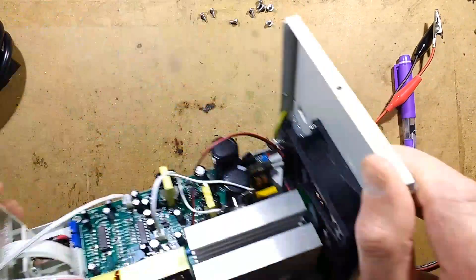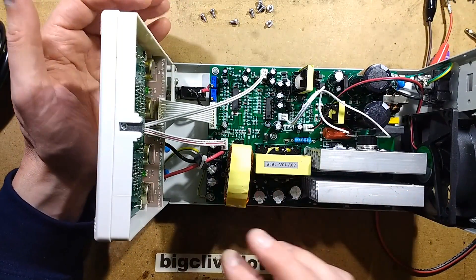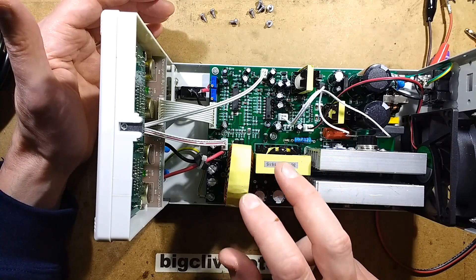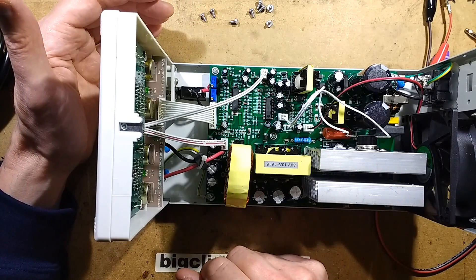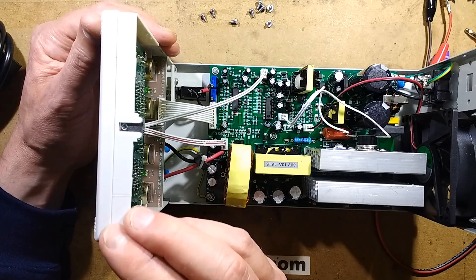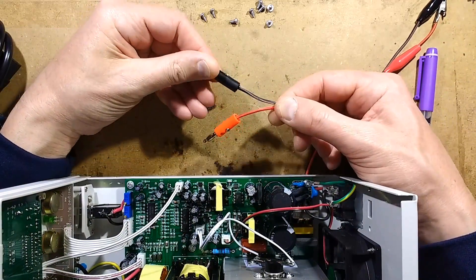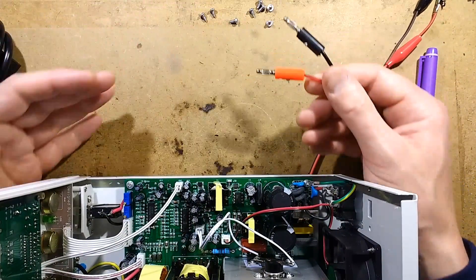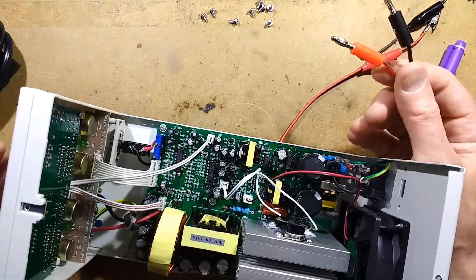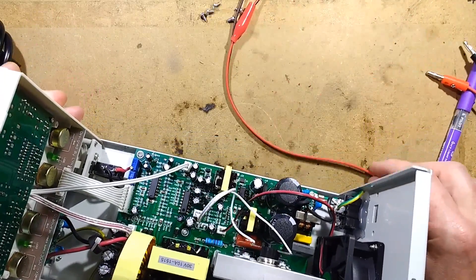So that's my guess as to what happened. I don't see much to go on fire here - the circuit board should be FR4, which can burn and smolder and track when things go wrong, but the most combustible bit is this front panel. It's very possible that one of these connectors just wasn't capable of taking 8 amps, or the screw down here just wasn't tight, causing a problem whereby it heated up to the point where the plastic ignited.